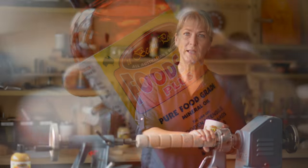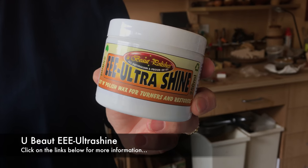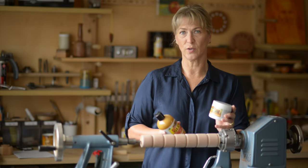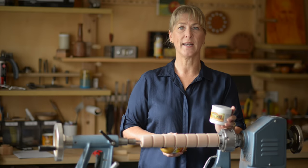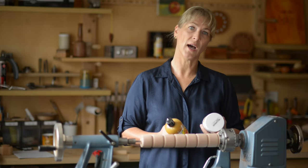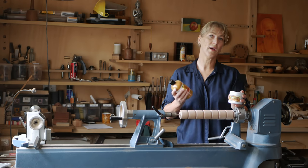So imagine you're ready to apply finish to protect your piece. I'm going to put Triple E Shine on this first segment — it's going to give me a base to push a friction polish on top of it. It was designed to work in conjunction with other products; it's not a standalone product. It will come up with a lovely shine but that would dull very quickly if you don't put a polish on top. The Triple E is great to prepare the piece to hold a friction polish.